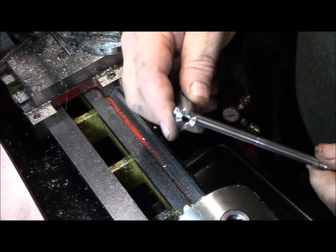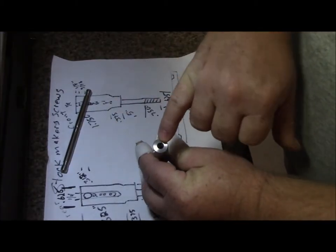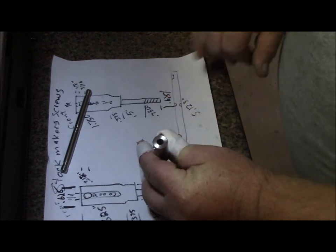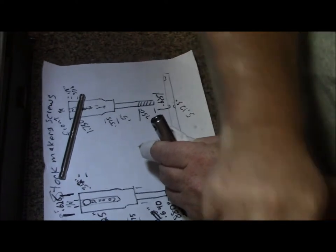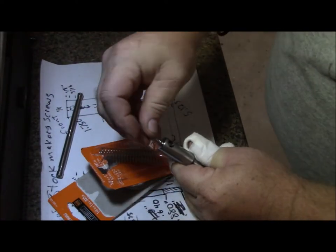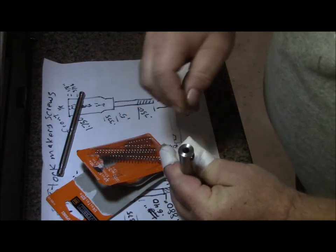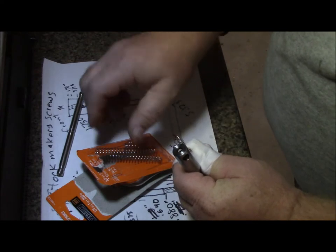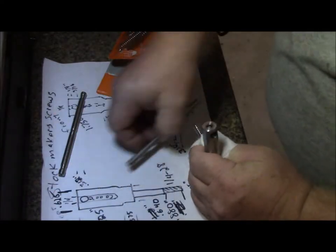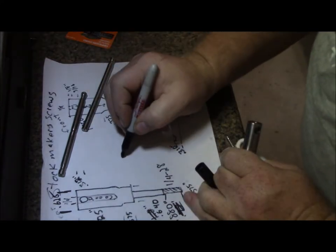Back to the drawing board — I put a hole in here for a spring and ball bearing, but the spring pack from the local hardware store is a little too big. The hole is 0.258, so I'll have to ream that out a little bit more. Then I want to take this stock and make my own bearing instead of waiting until tomorrow to buy a quarter-inch ball bearing.